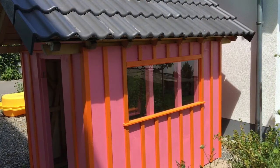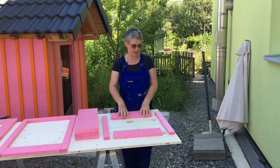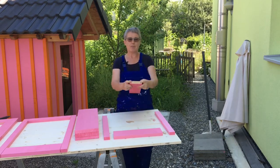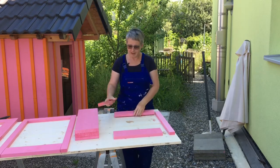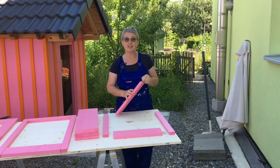As you can see, we've made another window here — this is just one pane of glass. We've made a window frame with a fixed window so this one can't be opened. For the door frame in front of me, this is the bottom door frame. We've used a biscuit joiner to make grooves in the wood on all of them, and now I'm just going to use these biscuits and join the framework together.